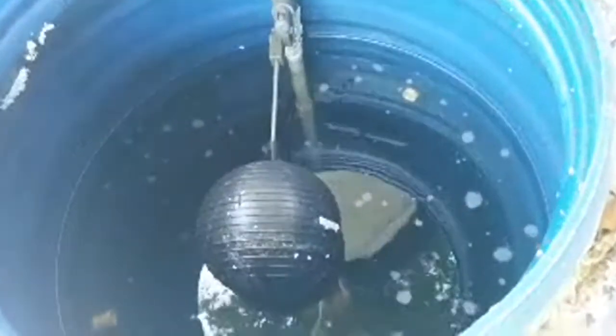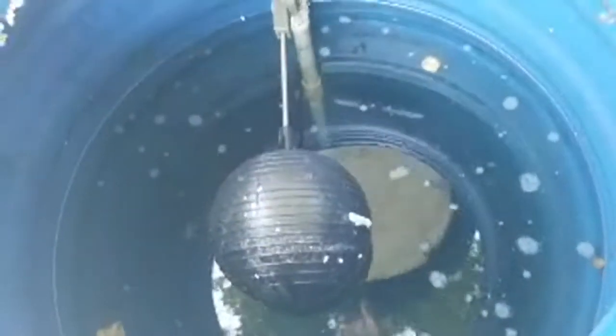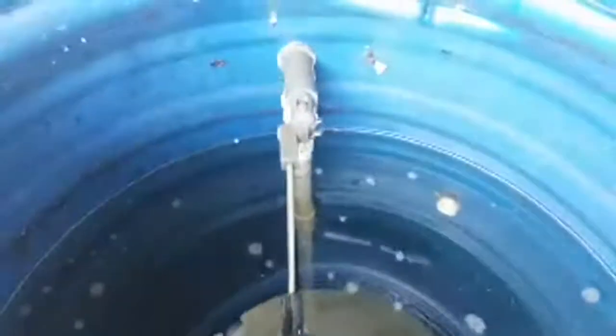This is what we discovered in Cairo, Egypt when we started Solar Cities back in 2004, when we were building with Mustafa Darsh Hussein and with Hana Fathi and with the crew out there, with Musa and Sabah and Hella and Miriam and the crew from Wadi Environmental Science Center. So yeah, you can use one of these float valves, bring your cold water supply in there and have it go down to the bottom to push it up. And then you just insulate to hold the heat in and you get marvelous results. So we're still at 119 there.